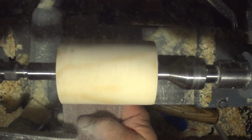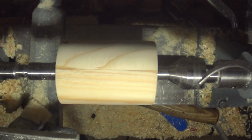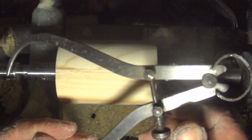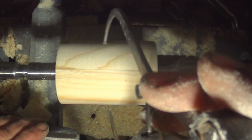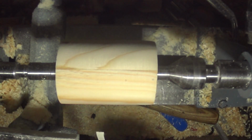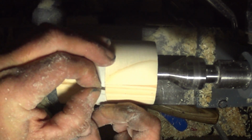I should explain something else, hang on. That'll probably do it. Right, first of all, I used a digital vernier to get an exact cylinder, and I set these and then turned it back just a 1/16 of a turn, so that they'd be just a little bit loose, so that I could use those to turn a cylinder that I knew was a millimetre too big or something like that. Then when one was accurate, I also made this measure, this tape, which we'll need 2 of.